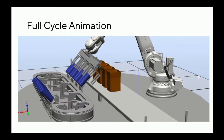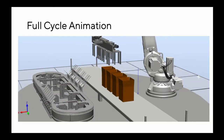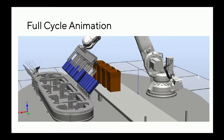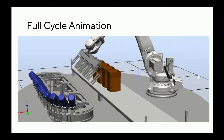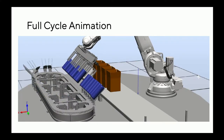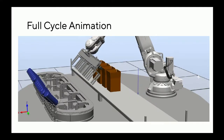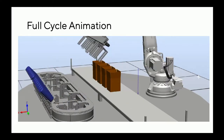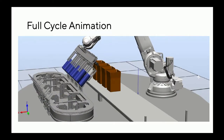One of the cool ideas about this: packing machines in the field today tend to have a lot of fixed mechanical tooling. Products come in, there are machines that stage up the parts to get the robots ready to pick them up. The robot end effector has to change tooling, machines upstream have to change timing screws and things like that. You can lose half an hour — maybe even an hour — of production time changing all those mechanical parts. Products are getting more flexible, and there are a lot of trends in packaging supporting that.